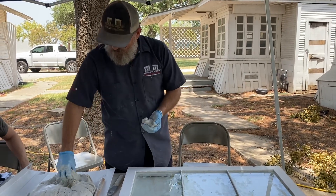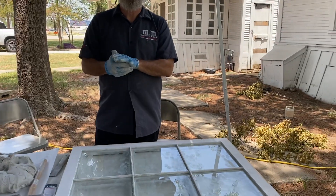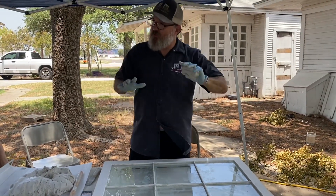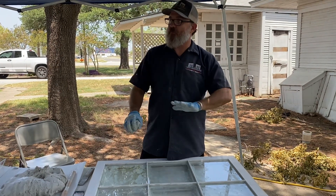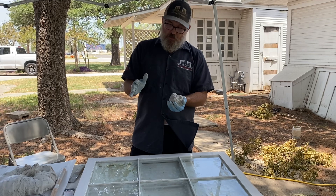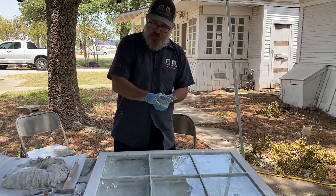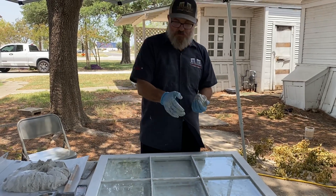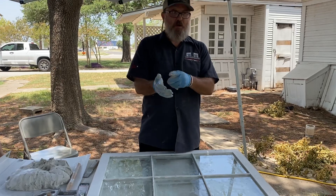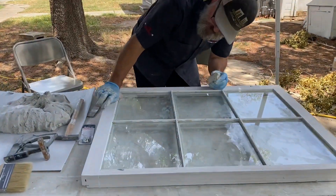Let's go ahead and glaze this thing properly. It's properly bedded - embedded means it's seated down in there, you got a nice bed for it to sit in. Now I'm going to take the glazing and shove it in like I did with my thumb, but this time I'm going to use the palm. I'm just going to push it in like that.